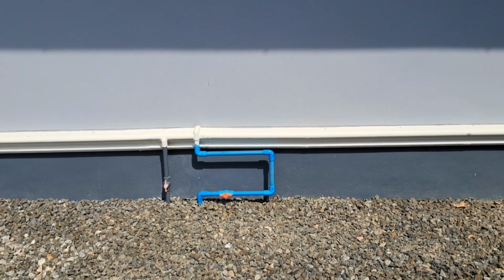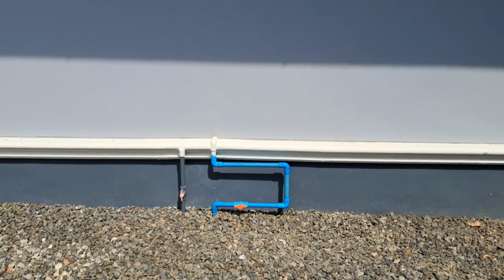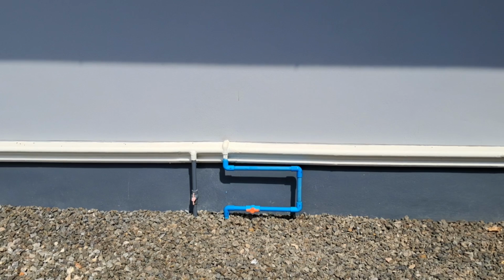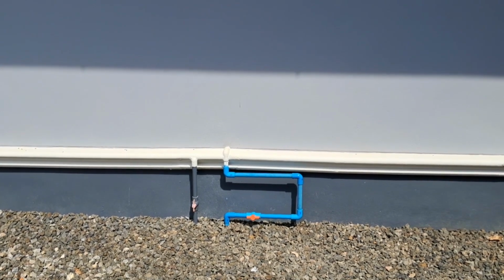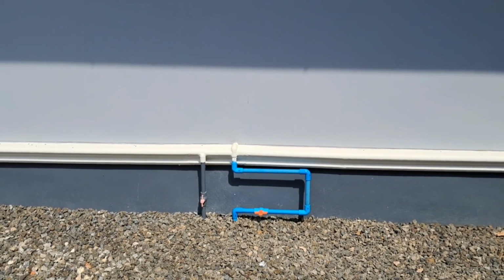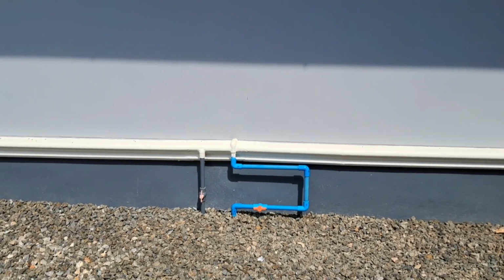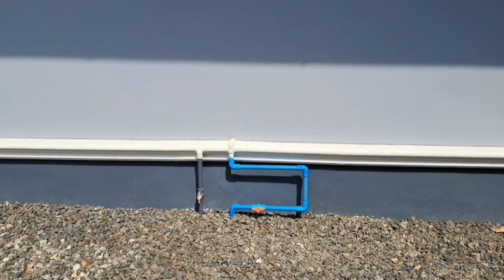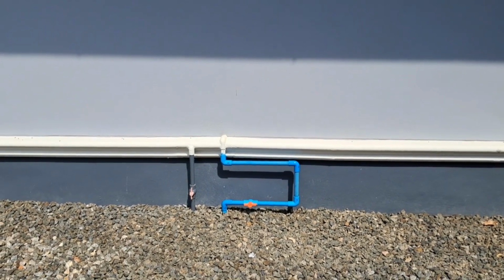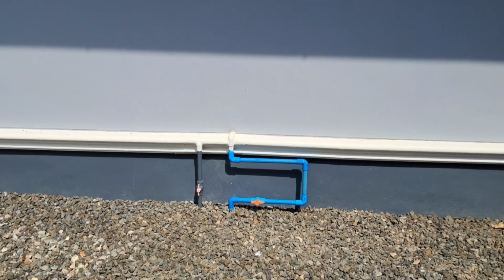And then I thought, oh, I'll just check my shower room, because we've got a very slow running basin tap there, and when I took the filter out of the spout, it was completely bunged up with muck, and when I turned the tap on to wash it, loads of muck came out of the tap as well, so the pressure was so low it was collecting muck just in the tap head. And the other thing was, it had a restrictor in it. Having taken the other filter off already, I knew what to look for exactly, and it was different, and it had a little disc with a tiny little hole in it, which was basically a pressure reducer.